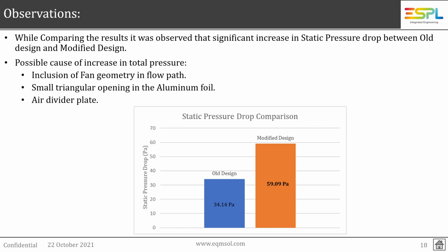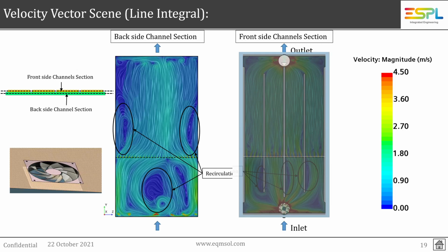before the divider plate, there isn't so much restriction, because the divider plate's purpose is to make the distribution between the upper and lower channels. So the flow numbers are not like they should be, so I will add more triangles to the flow on this side. So now I have the 7 triangle holes before the baffle plate, and I will add more here, and the shape pattern I will make like it is here. So one hole is like there, and now the entry hole is right at the bottom of the plate.